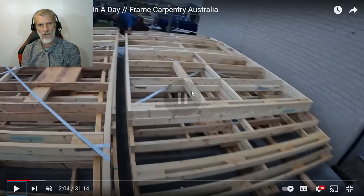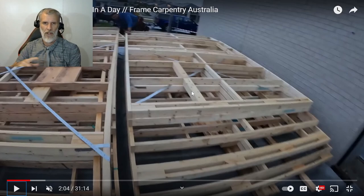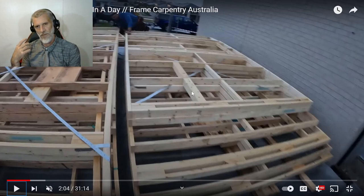Now you'll see on the ground, on the slab, about 2 hours or an hour before the framers arrive, the builder will send someone out and they'll mark on the slab where everything needs to go. Make sure everything is square. So as a framer, all you do is show up, get the correct frame, put it in place, follow the line, whack it into the cement, put it all together, make sure everything's square. And that's done. All of these frame pieces already have the windows set, doors already cut out of them, everything is perfectly square.